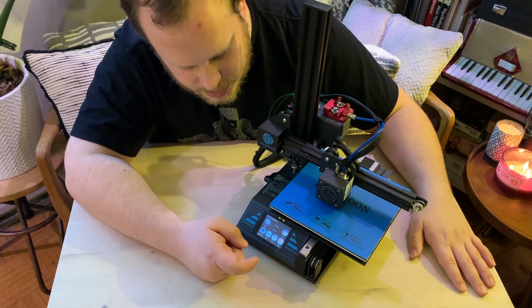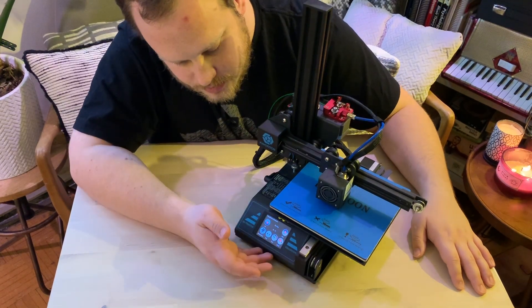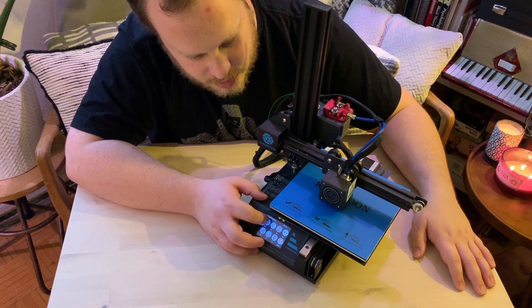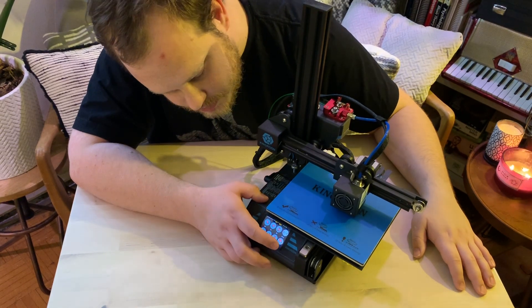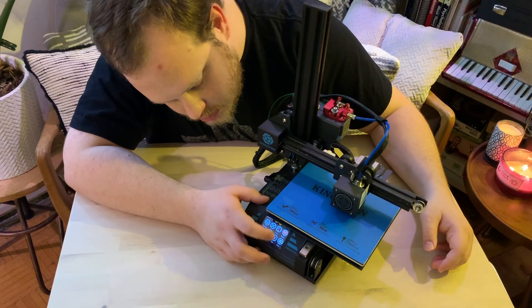If you've got it preheated, you can go into the extruder menu and select the steps for the extruder to extrude and reverse the filament out of it — good for a manual filament load option. There's also the move option which allows you to jog the axis in different directions. So there's X plus moving in one millimeter increments, we can do 10, we can do Y, then we can do Z. The lead screw on the Z axis does bind occasionally but you can just apply a little bit of oil or even WD-40 and you don't have to worry about the binding too much.